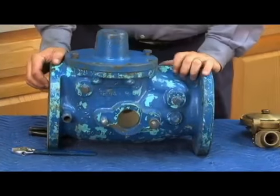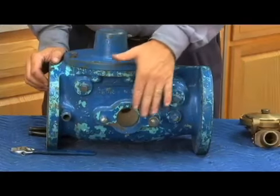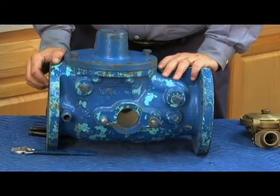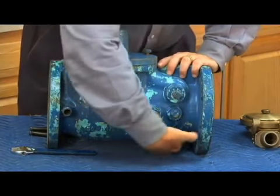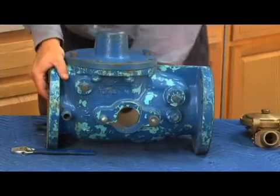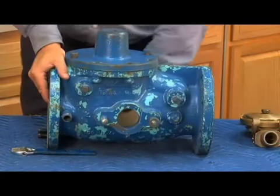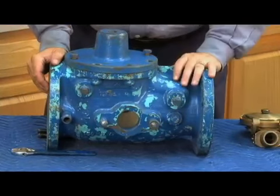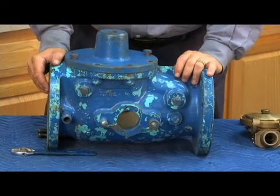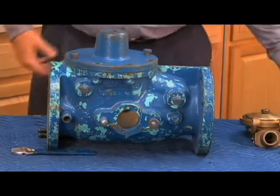Again, the relief valve is mounted on the side, the CDHS-20. If it was a Model RP, which would have used the same basic configuration, the CDHS-14 relief would have mounted on the side. The RP1EX had this flange under the bottom, pointing straight down, on the EX series. The 308-1 toggle lever check and the 308-4 toggle lever check, the check and the body are very similar, almost identical. Some slight differences in how it was built.